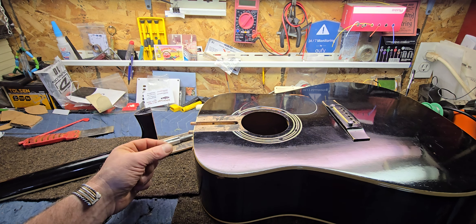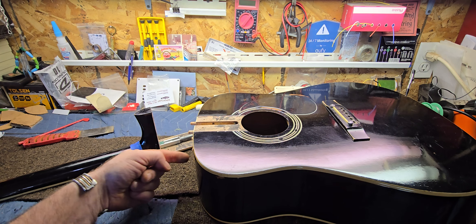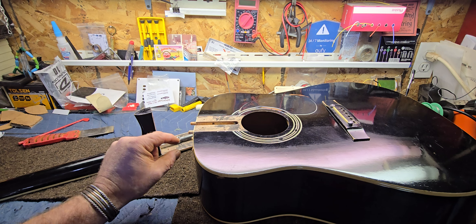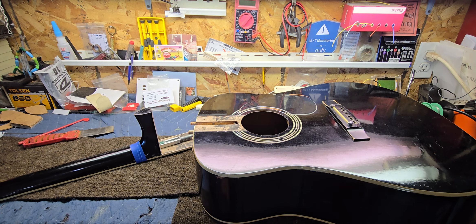You've got to have the anchor lined up perfectly with the hole you drill through the neck block. You want that hole not too big — you don't want the bolt flopping around so it can walk. It's going to have to be the right diameter so when you put the bolt through, it's pretty close, not a lot of slop.